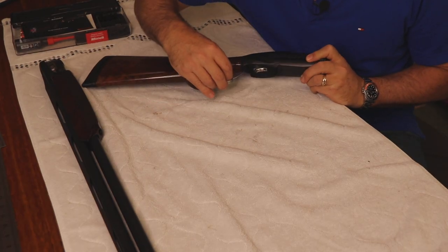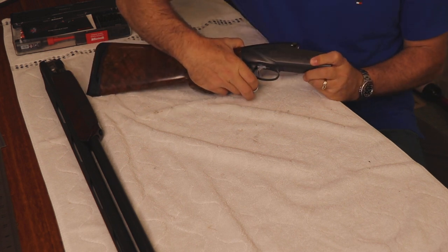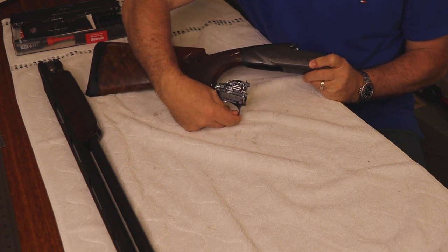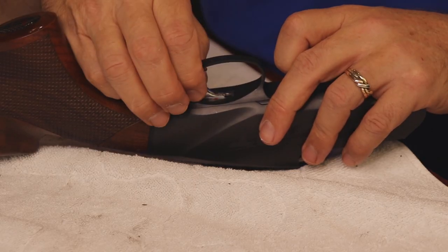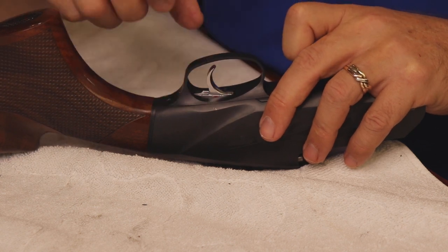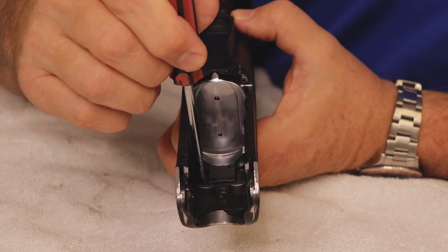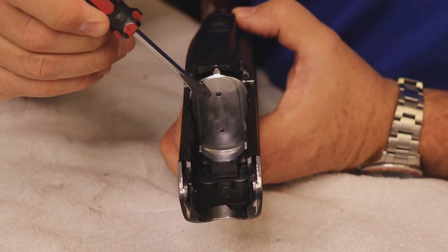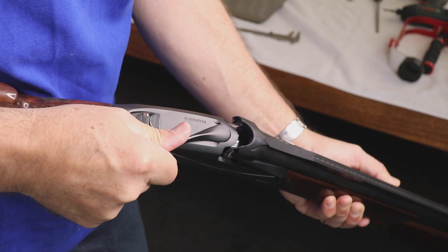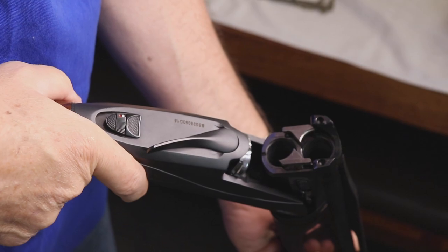The trigger assembly is simple to take out for cleaning or maintenance — you simply insert this gadget into the hole behind the trigger guard and push it until you hear it click, then they simply drop out. The trigger is adjustable with five different positions to cater for a good variety of hand sizes. One other feature I like is the detachable breech face to aid in maintenance — a very smart idea. And there's an ergonomic-style top lever that is comfortable for both left and right handers. Very stylish indeed.